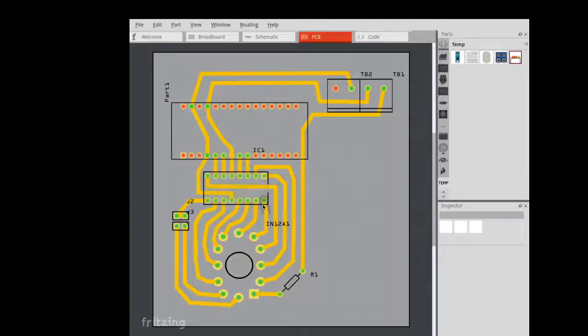So for instance, the output pin, I believe this is the output pin for pin 8, I think, but when you follow the line trace down like this, which pin is this? This is actually pin 9 on the Nixie tube, and the same way, nothing is connected in the way that it should be as per the data sheet of the IC. All the pins are connected wrong, but the advantage is they're all on one side of the PCB, and there's no overlap, there's no crisscrossing taking place.